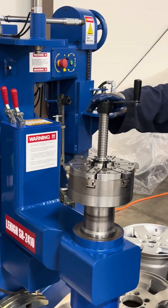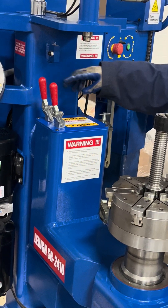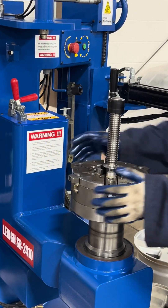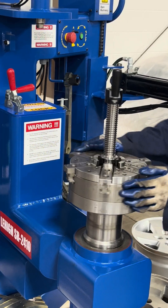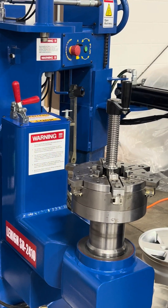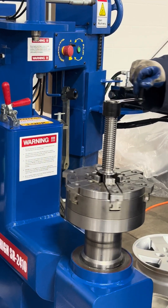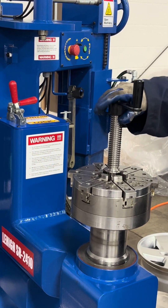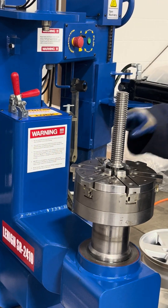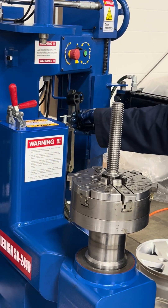At this spindle, we have an acme screw with two handles: center and lock. To do centering, you push this down — it's engaged — so now you can move in and out. You can see the jaws are moving: counter-clockwise moves them out, clockwise closes them toward the center.